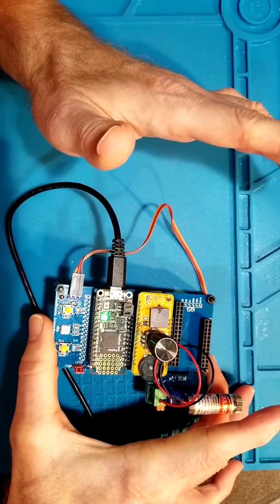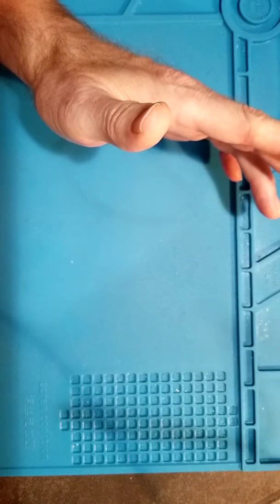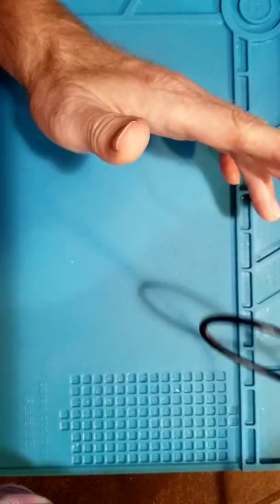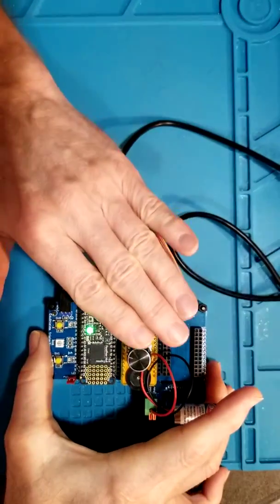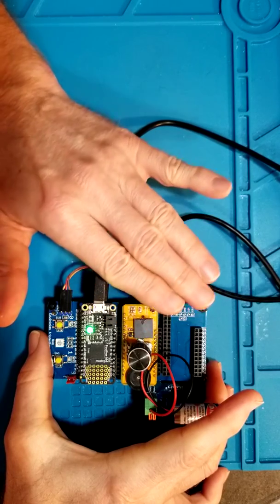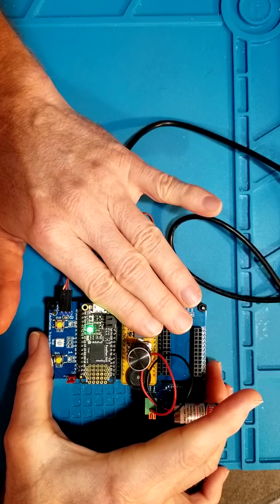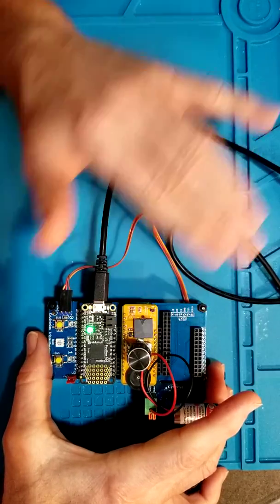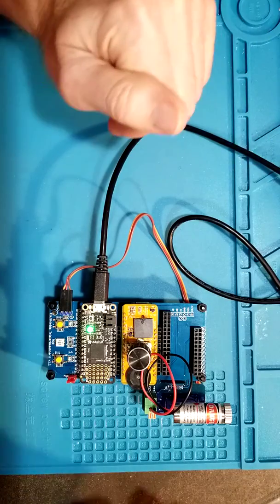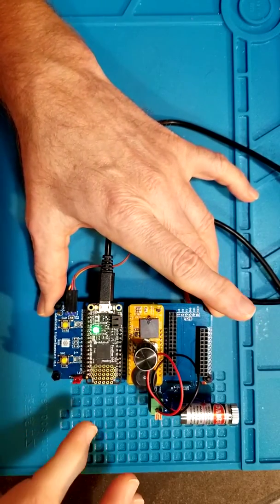If I do this in really bright light, in fact if I move it closer to my light source, it saturates to its maximum value of 1.0. As I move it away and manually darken it, it gets pretty close to 0. As you were instructed in the safe handling part of the documentation for the kit, try not to touch the board. I'm shielding it, but not really touching the board. So that's the test of the light sensor. As you can see, it's a single value tuple, single plot axis, just like the potentiometer and similar to how the rotary encoder works.